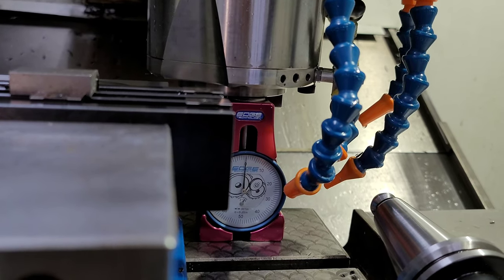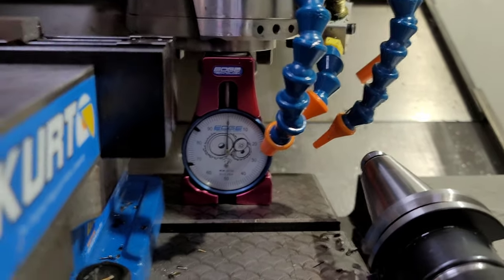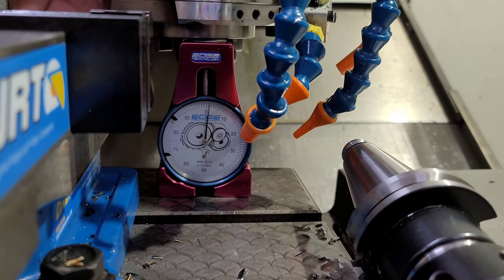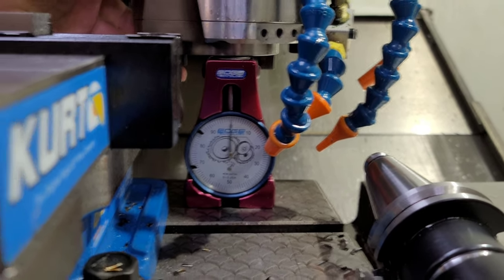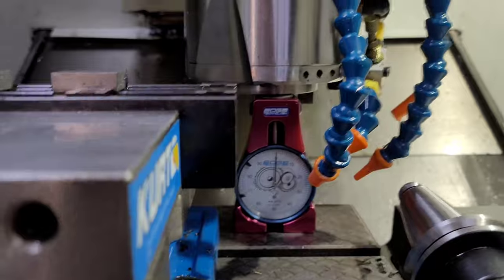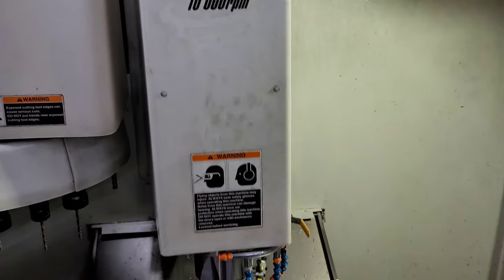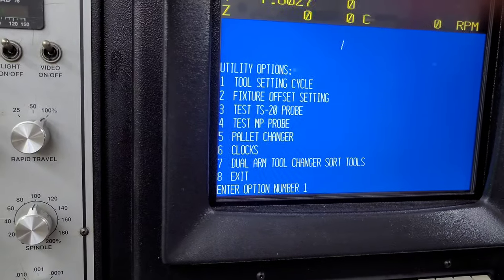This is basically just giving you a reasonable gauge length for your tools. You'll notice that this isn't even really flat — if you turn the spindle you'll get a different measurement in every spot, but that doesn't really matter. This is close enough. Say that's good, go ahead and go up.